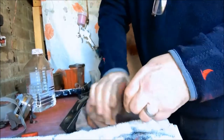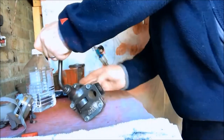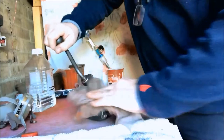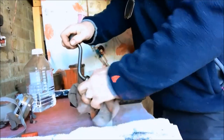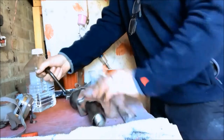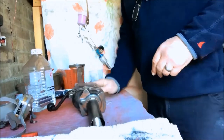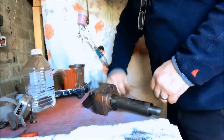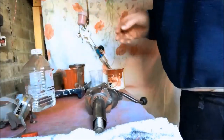I've wiped the other three - these have just come off the radiators in the house. I need to get a bit of tape on there. This is acetone on a rag - I'm just degreasing them as best I can to get the paint to stick in all the right places. I had them in the house for two reasons - I want to get them to sweat a bit, because steel or cast absorbs moisture when it's in bare state like this. When you warm them up that moisture comes out as condensation, and you don't want that condensation underneath your paint.